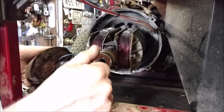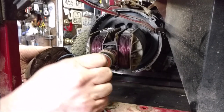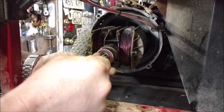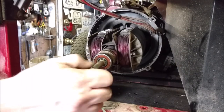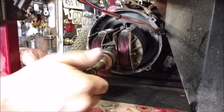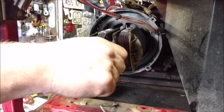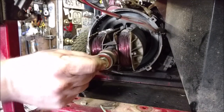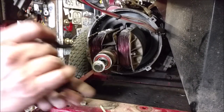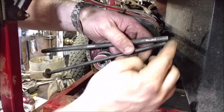Since this one doesn't have threads, I'll tap threads in there. I get a bolt that just barely doesn't fit and tap it in. I want the bolt to have about a quarter to half inch of travel, and I need a rod that fits in there at the right length. I take my original bolt, stick it in, and find out exactly how long until it reaches those threads to know the depth of the hole.